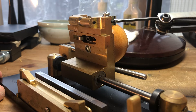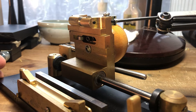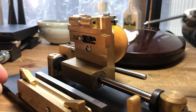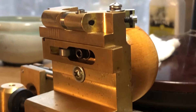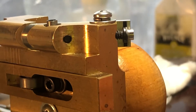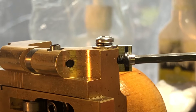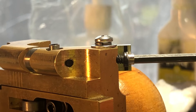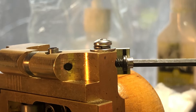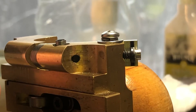When I undo this, it will make room for the blade to go to the right, or up and out of the machine. The screw collar is now in its southernmost part of the slot — leftmost. Then, if you watch those little knurlings on the screw, I turn it to the left just the tiniest bit until it makes some room for me to push the blade to the right.